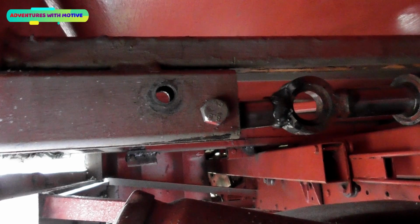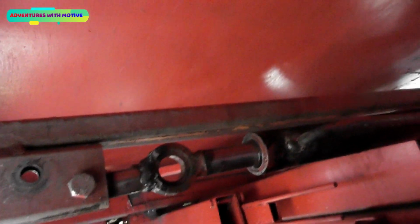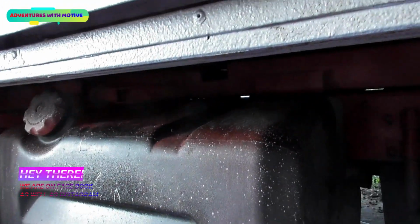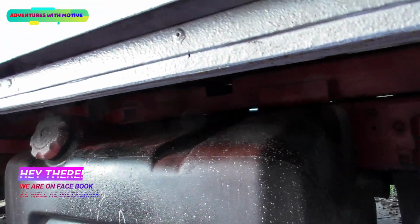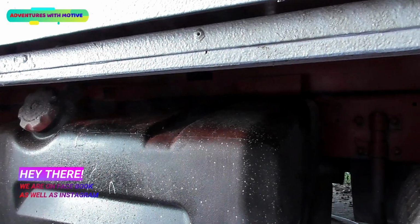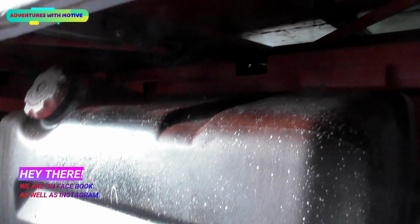So that's it, people. That's how you convert a lorry cab tilt double acting ram into a regular everyday ram. I wouldn't want to use these on any JCBs though, because they are very high pressured, and I don't think that ram would survive for very long. But for simple little tasks, for pushing and pulling, I can't see no reason why they can't be used, especially for the hot rod custom car industry.